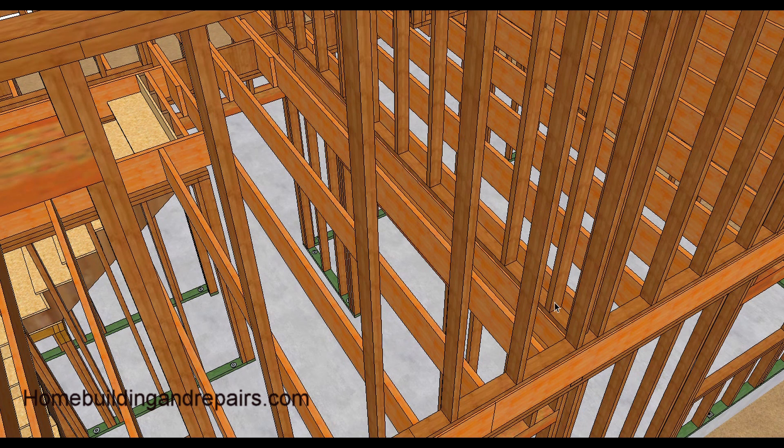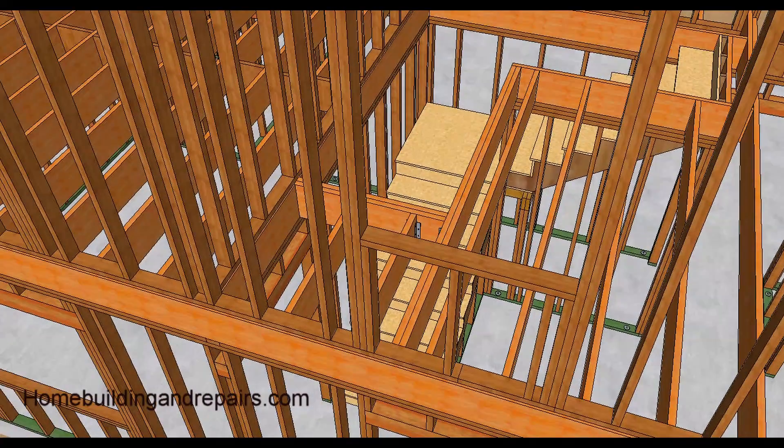Here's the wall above I was talking about. Single joist — a wall supporting a wall above, even if it is not a load-bearing wall, will require a double joist underneath it. If it is a load-bearing wall, it might actually require a larger member — maybe three joists or some type of beam.